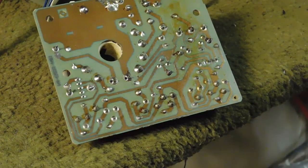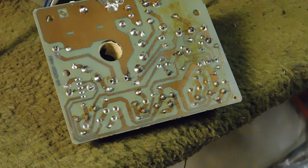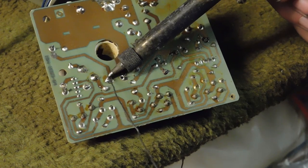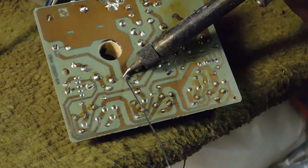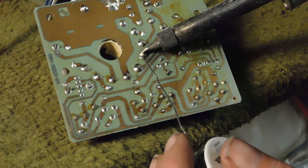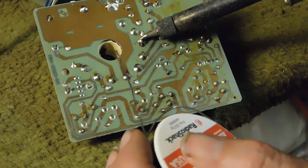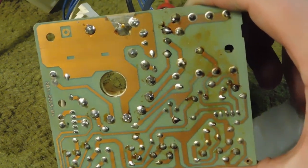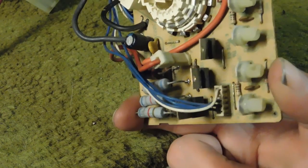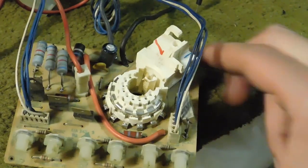Okay, we're all cleaned up now. I can tell there are a couple of legs here that I need to just add a little extra solder to because there's a small hole that built up. Since we have such fresh solder on here, it's going to fill in those little holes no problem. There are four in total — these ones over here have a small little hole that didn't quite fill in all the way with the solder. Those are done now — decent solder on them, no holes, they're solid, and they're not flowing through the opposite side. That's how you replace a neck board socket.